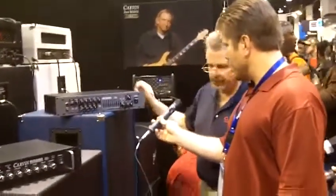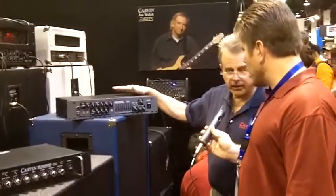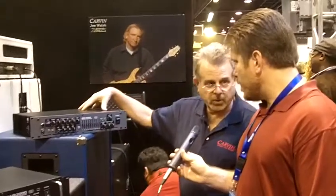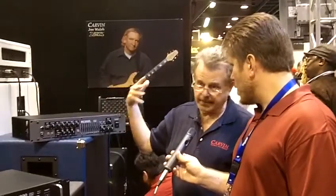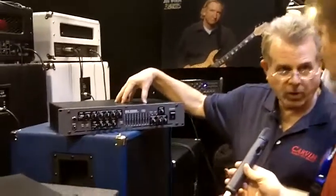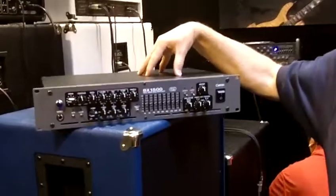This amplifier has been evolving, and again, the serious request was to take out the weight. So we have a switch mode power supply in this, and then in the output we have Class D. Class D is super sounding, and one of its best points, it's 94% efficient. You're not taking lots of power out of the wall, so you have that efficiency and you have the power. 1,500 watts again at 2 ohms. That's actually 750 a side at 2 ohms, but you could bridge it at 4 ohms for 1,500 watts.